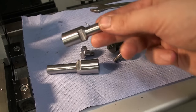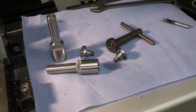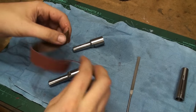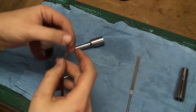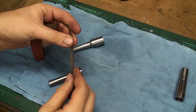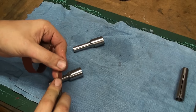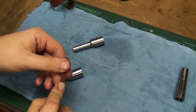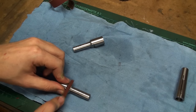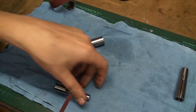the surface finish is not good. Let's go to the bench and remove them. Okay, we're going to use some 400 grit emery paper, which is easily ripped in small strips. And I rip them to a width of a needle file, flat needle file, and just do it like this. Now we have an emery file. And now we can just work down these surfaces by hand and also break the edges lightly of the milled areas.